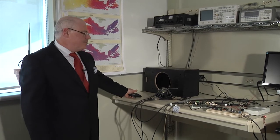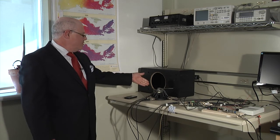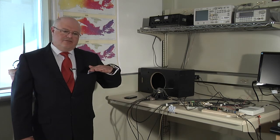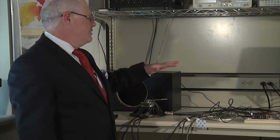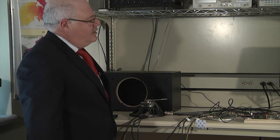So to briefly summarize, what we have shown here is the capability of our transducer, which is a very simple, inexpensive, robust transducer, to detect a variety of vibration events based on knowing the normal vibratory signature of this environment, of this room, of this floor, of the speaker and everything else. And we were able to demonstrate that a departure from this normal environment was able to be detected and classified, at least in the low frequency, high frequency sense, general fault versus only high frequency fault.